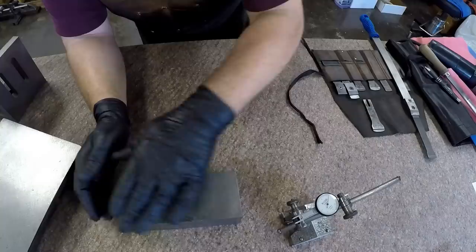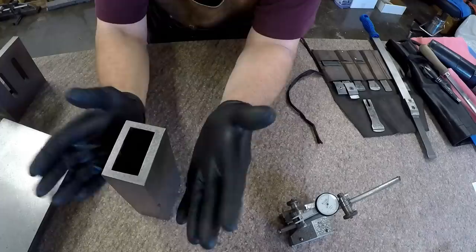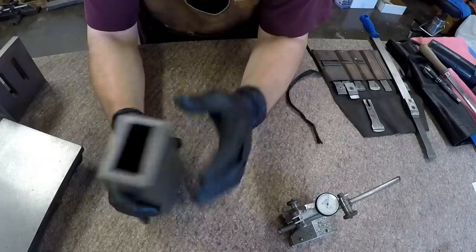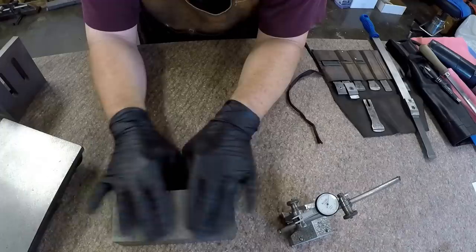Well, they could be parallel. They could be V-shaped, up or down. I mean, who knows? So the next task I did was to scrape flat the bottom surface, and now how are we going to test these two sides and the bottom? Well, the first thing we can do is scrape the first side flat, put it down on my granite surface plate. I can take a gauge block of some sort, and I can lay it on here,